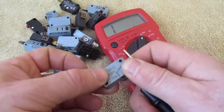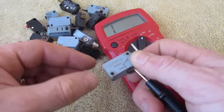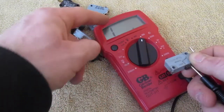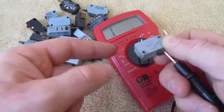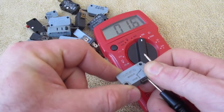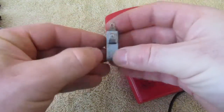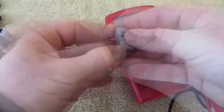These ones have all been removed. What I'm going to do is stick my leads into the terminals. This one is reading — we have no reading right now. So when I push this down — this is an open switch — I push this down and I should get a reading of about one. And I am, so this is telling me this switch is working. But it's pretty greased up so I'm not too worried about this one — I don't really want to use this one.